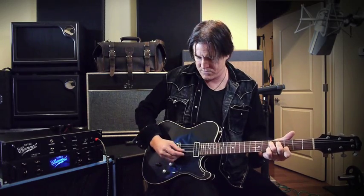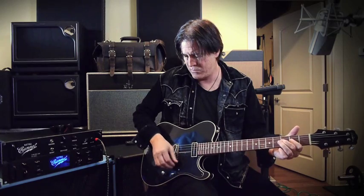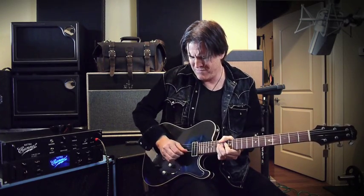So if you listen to this — it responds like a real tube amp. I'm using the volume to clean up a little bit. The wonderful thing is you can do this at low levels because our amp has all the power tube distortion already built in. You can use our power amp as a master volume network to control your monitoring levels — getting great sound at conversation level all the way up to using eight 4x12s per side and really peeling paint off the wall.